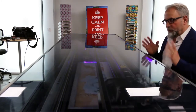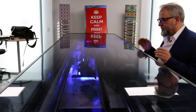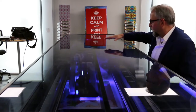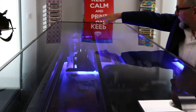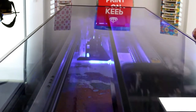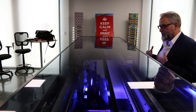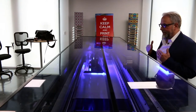What's really unique about our system is that we're able to lay down all the ink at once and then cure after the fact. The print head carriage goes back and forth laying down all the colors, and then the curing gantry sits right here and cures the material. The UV gel ink is a gel ink, which means the inks don't coalesce, they don't mix — and this is what allows us to achieve these types of speeds. We're going to print this one job first and take a look at it.